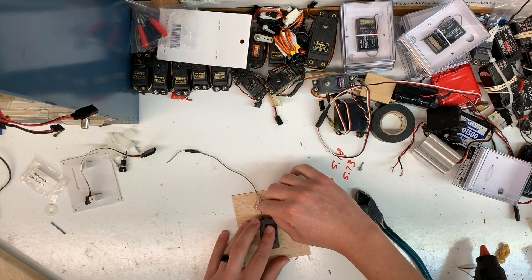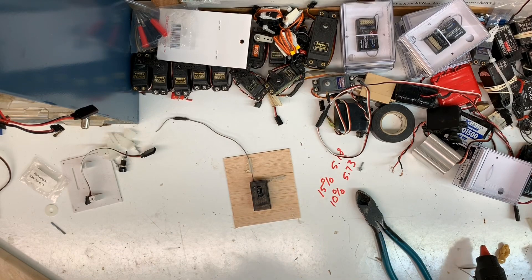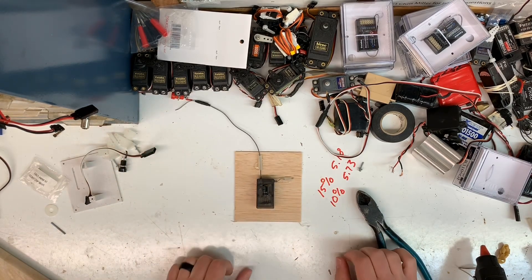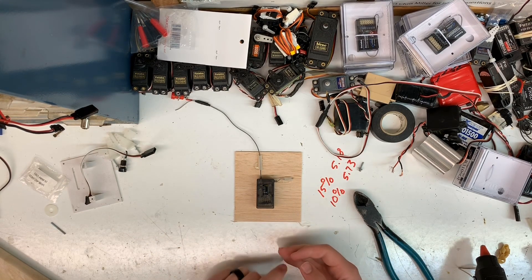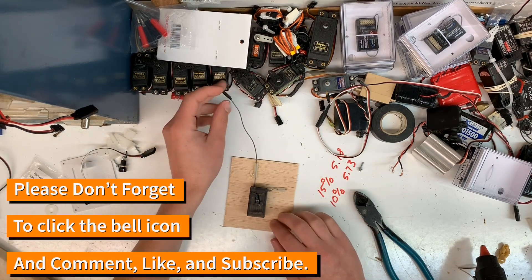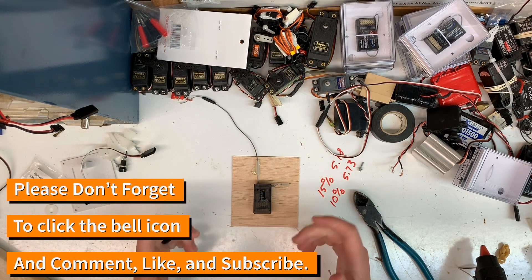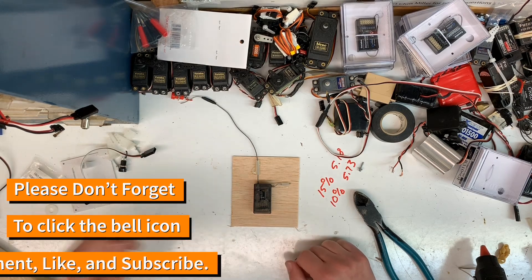The key is to keep the antennas as straight as possible and away from one another. That way you'll have a receiver that shouldn't have any issues with diversity antennas touching or interference. Also, it's always good practice — especially on a Spektrum — to keep the antennas away from anything that's carbon fiber or highly conductive. Keep that in mind, and if you have any questions, feel free to ask. Don't forget to like and subscribe and leave your comments below. Thanks a lot.